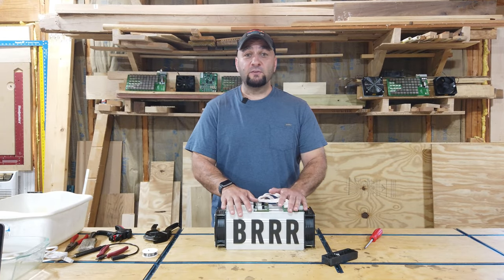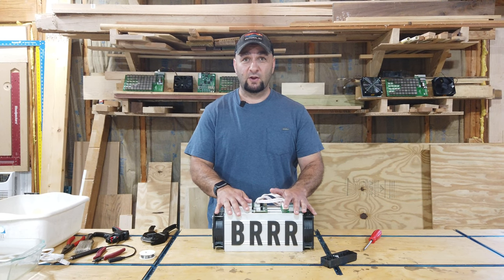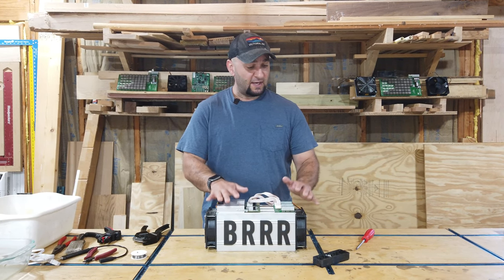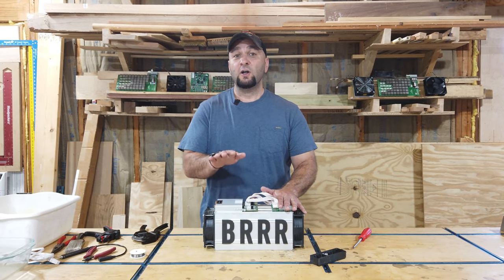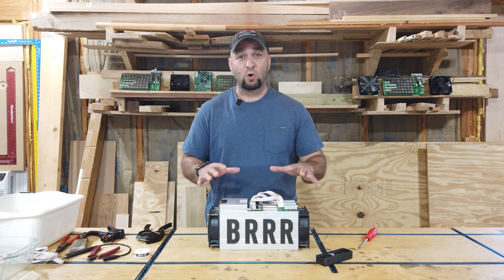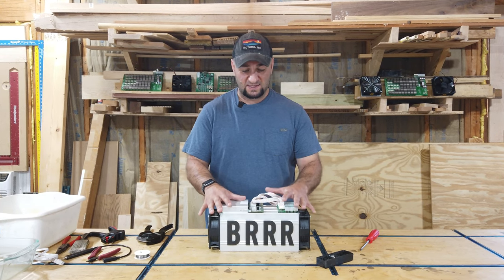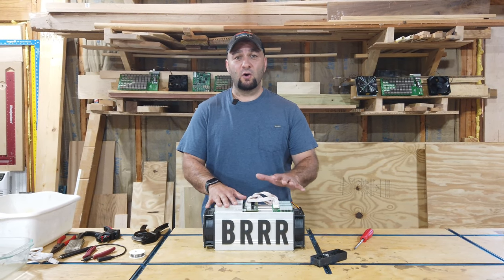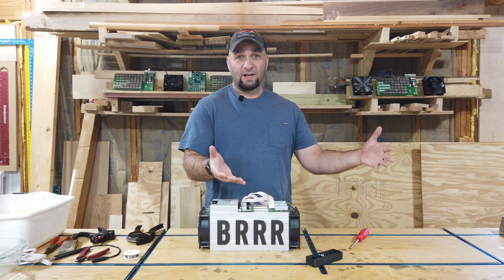All right. Now that you've seen an entire parts list and the tools that you're going to need to build one of your own Nakamoto Heating Solutions at home, we're going to get started by taking apart this S9. But before you even start getting your hands dirty and taking this thing apart, we strongly, strongly suggest that you download and install the BraiinsOS+ operating system. It's an aftermarket firmware that is going to give you a lot more control over the power consumption and dynamic power scaling of this system. The reason why we suggest you do this first is because it'll allow you to test and make sure that the OS+ is already working instead of waiting until you've built the entire system and then finding out that it doesn't work.